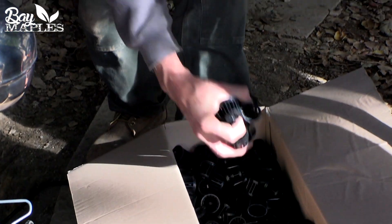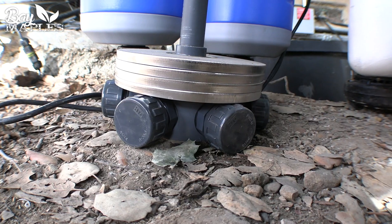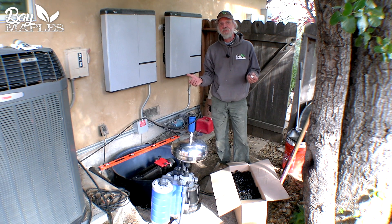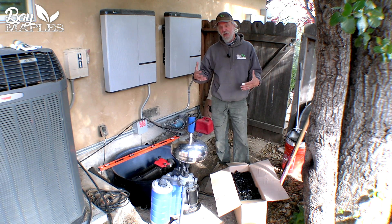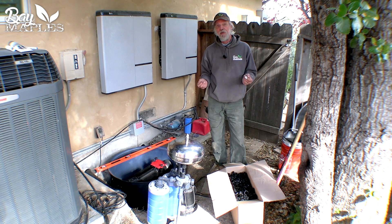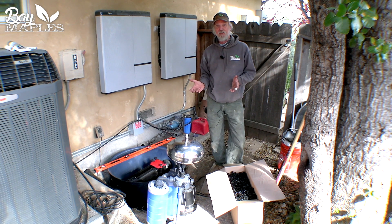We are going to put this material in the tank and we will have a blower going down into the bottom of this unit — the blower aerates the water almost constantly. It's typically on for about 15 minutes and then off for five, so you have a continuous aeration cycle going, and microorganisms grow and start to eat the soap and biology and whatnot that you would find in the water. This is actually becoming a mini wastewater treatment plant at your house.